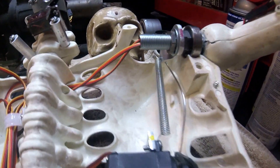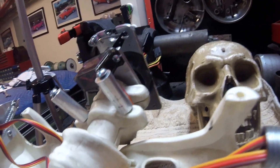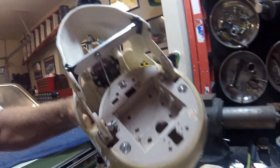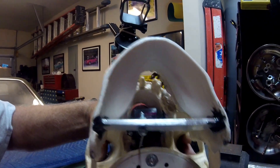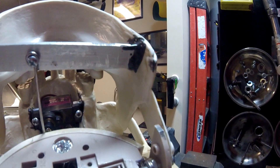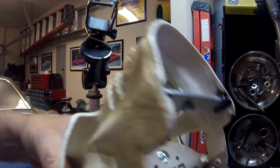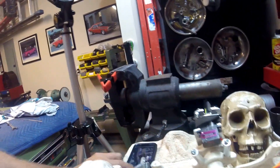The servo mounts for the shoulder. Another shot of that head area — I'll grab this skull so you can take a look at the servo up in there. I put that bar in to mount it. Took out the screws and just did a 6-32 machine screw with a nylock so the jaw would open and close.